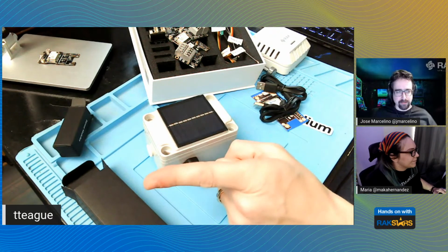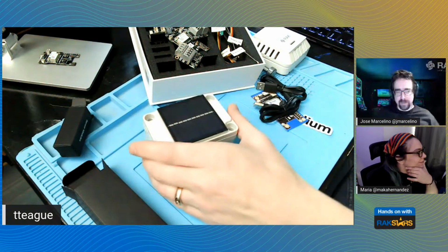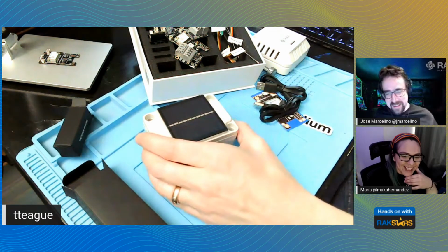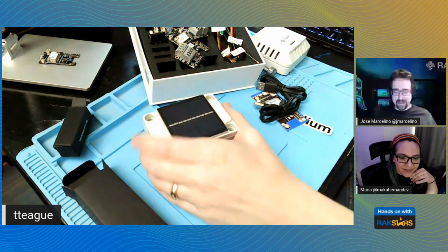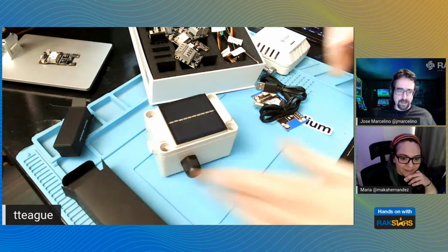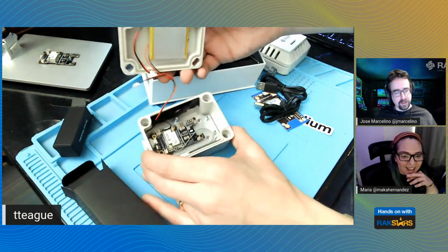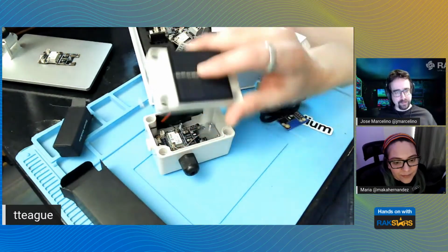For the most part, some OLED displays have your power and your ground switched. So be very careful when you're doing that and verify, because there is no standard reverse current protection on those little OLEDs, and you'll fry them in an instant. But for the most part, you just throw a header on, stick it on. It's easy as that.